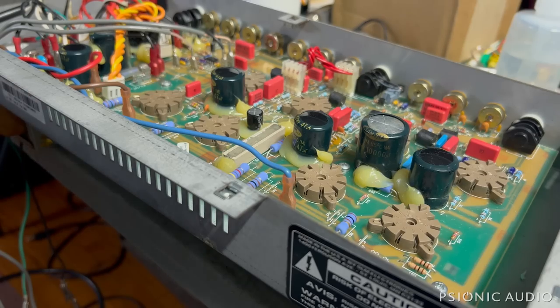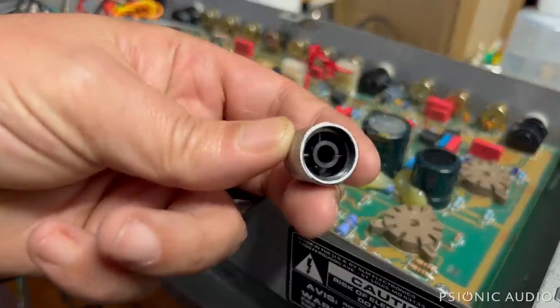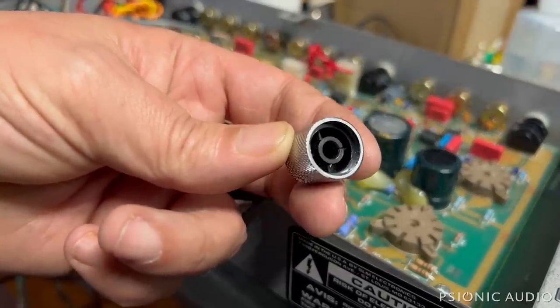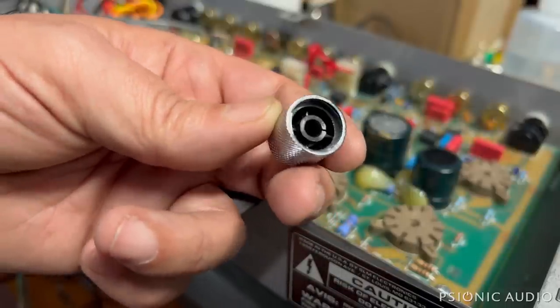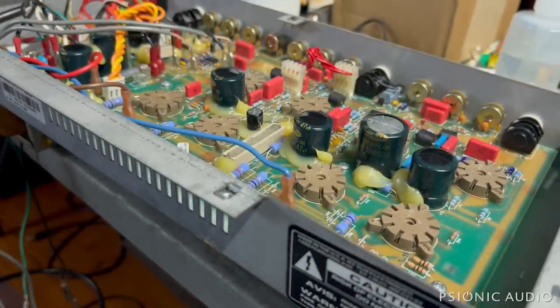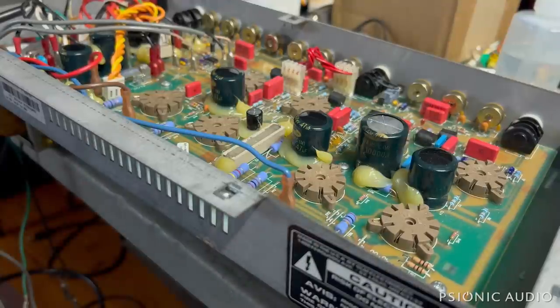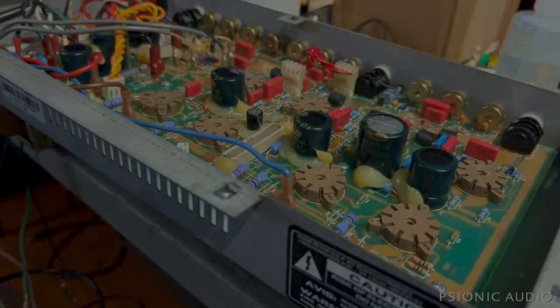The next things I need to do: sort through all the knobs — some are not broken, some are. The broken ones I'll get in there with a little super glue to keep them from spreading open again, and whichever knobs need it I'll put a little masking tape on the shaft. But I'm going to hold off until I speak to the owner, because he may want it recapped. There are about nine caps that would definitely need to be changed out — the cathode bypass caps tend to last a lot longer than the bigger ones. Spend as little or as much as you like — this is a Crate Vintage Club from the 90s, a good amp for what it is. Just making sure all the connections work made a dramatic difference. I think the owner will be very happy with this.